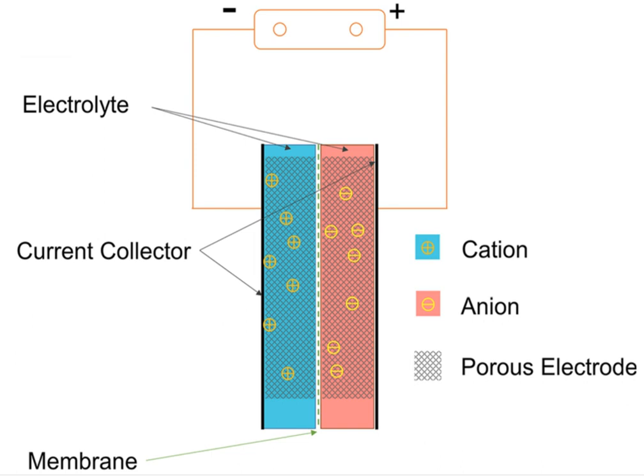Conventional capacitors, also known as electrostatic capacitors, such as ceramic capacitors and film capacitors, consist of two electrodes which are separated by a dielectric material. When charged, the energy is stored in a static electric field that permeates the dielectric between the electrodes. The total energy increases with the amount of stored charge, which in turn correlates linearly with the potential voltage between the plates. The maximum potential difference between the plates, the maximal voltage, is limited by the dielectric's breakdown field strength.